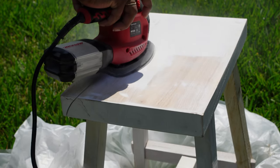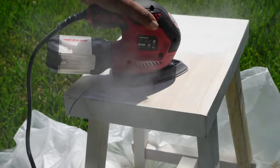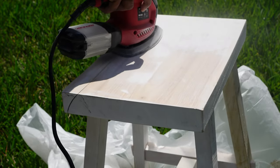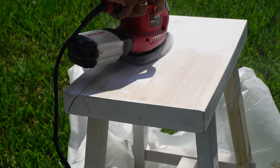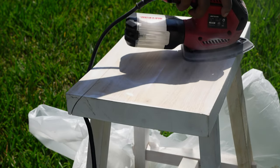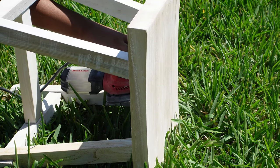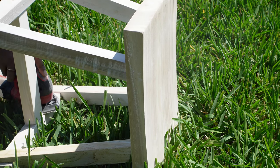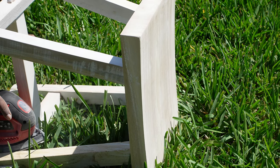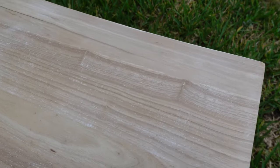I did not like the white paint that came with the stool, so I went ahead and stripped that off with 120 grit sandpaper. I later found that I should have been using the 60 grit because it's more gritty. So in the middle of the project I converted to that. To get the paint off, just use the 60 grit sandpaper — it would save you a lot of time. I sanded all the surfaces to get rid of that white paint texture, and underneath that paint was exactly what I wanted: that oak light wood.